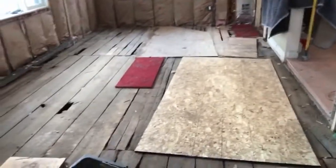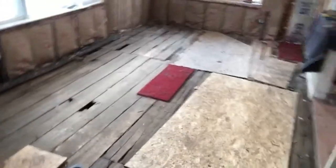We're going to use the exact same technique they used in the kitchen over here in the dining room, to have all one level and get rid of that step up into the kitchen. We started the process today by ripping up the subfloor — there were two levels of it. When they put these in they didn't have plywood readily available, so they used whatever scrap wood they had: shingles, linoleum, newspaper. We're going to get rid of all that and use five-eighth subfloor, then three-quarter floorboards from a mill in Massachusetts that will match the existing floor to keep that barnyard feel.